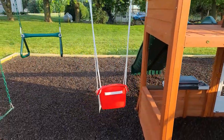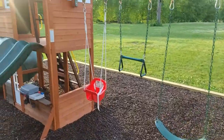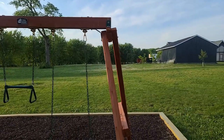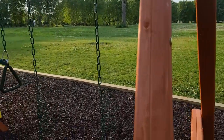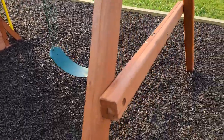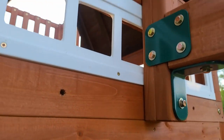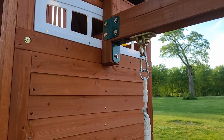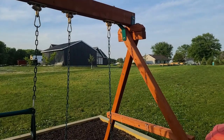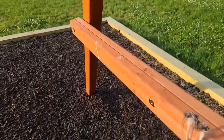I will note that Kids Craft has been great about sticking behind their product and getting us some new stuff, which actually arrived this week. On the actual construction, the beams above the swings and the frame itself are made out of laminated dimensional cedar. They've glued two-by-fours together and then have screws you install through them to keep from checking or coming apart. Same thing on the ends and the top — they use two-by-sixes, put two together and laminate them. Laminated structural lumber is pretty common in construction. There's also a screw in the middle that's supposed to help prevent checking in the wood.